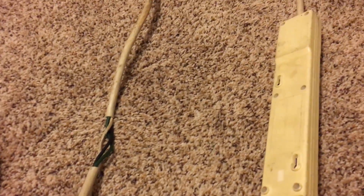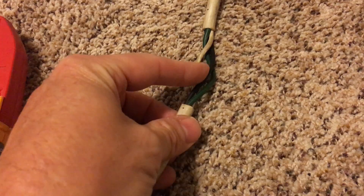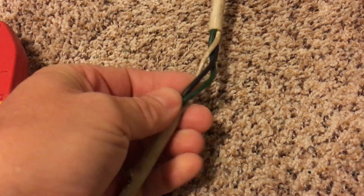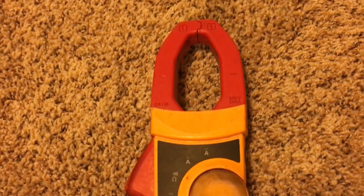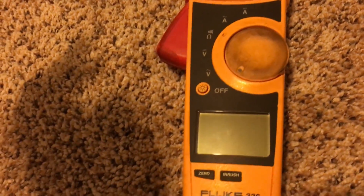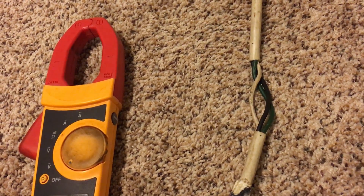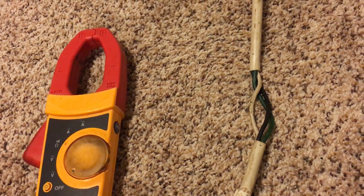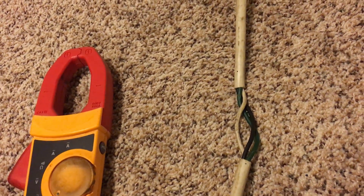What I have here is a standard surge strip with the wires exposed — the hot (black), neutral, and ground. I'm going to put my clamp meter 336, or any clamp-on style amp meter, on it and use a function called inrush. We need inrush because a refrigerator contains a compressor that draws higher watts and amperage on startup than during normal running, and we need to know that to properly size our generator or inverter.